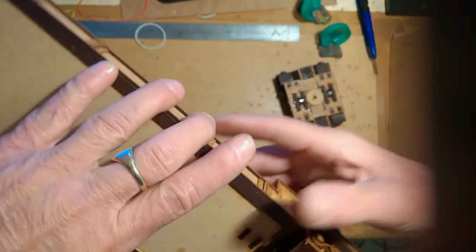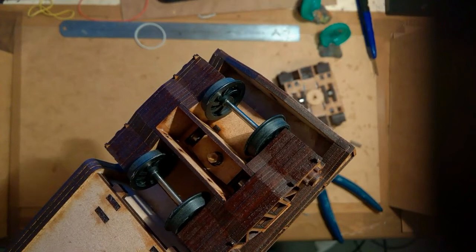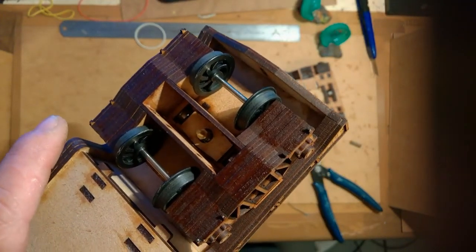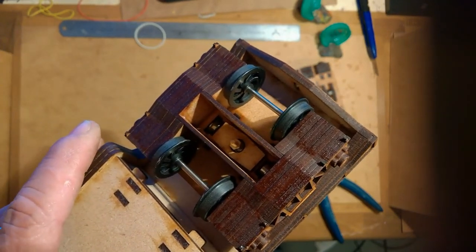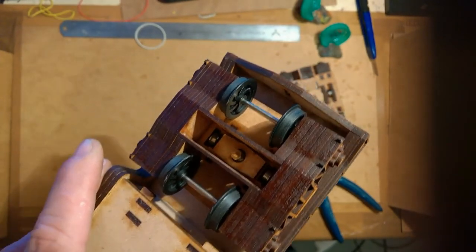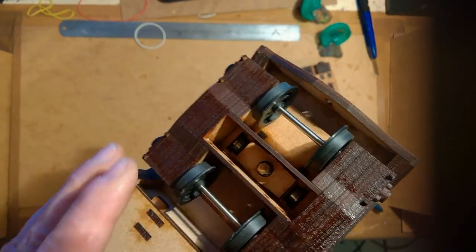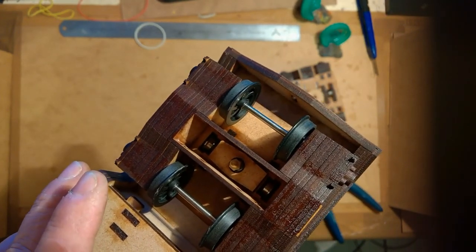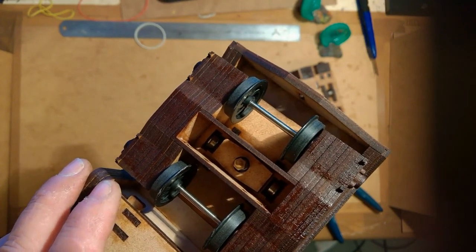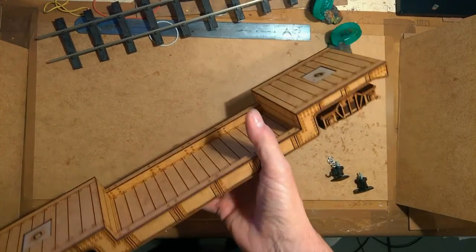So then we do exactly the same. Now, before we do that, what we then got to add is the second nut down onto the first to lock that in position. So we use the two nuts to lock each other. The size of the thread I use is a 5BA, because that's a very nice fit through a 1/8 inch bearing. But unfortunately I was unable to source any 5BA nylon lock nuts. So we have to use two brass nuts and just lock them to each other. And there you have your now completed model.